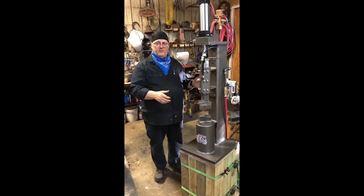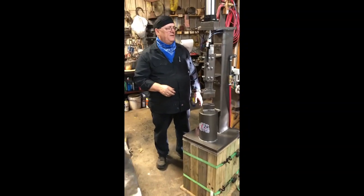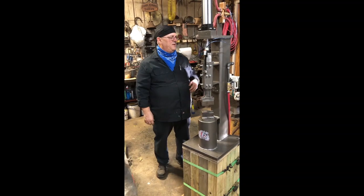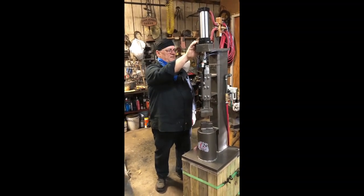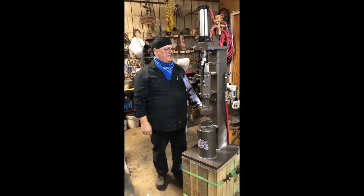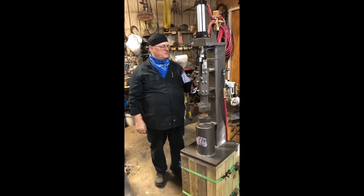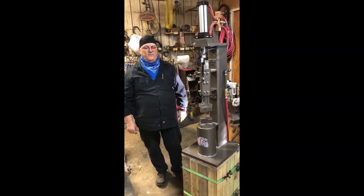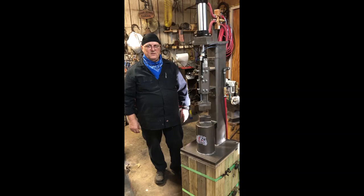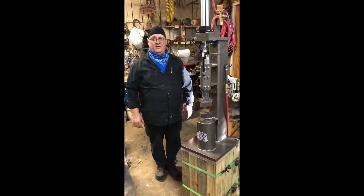You've seen it rocking while I was forging — I don't have it bolted down because it's not going to live here for long, hopefully. You need to put some angle iron tabs on there or something and bolt that down to your floor. The air cylinder on this one is a 2-inch bore, 6-inch stroke. I have it set at 80 pounds. You need about 4 cubic feet a minute for your compressor at 80 pounds, and about a 20-gallon tank to have enough gulp tank for this to run. But it runs smoothly and you can run it on a smaller air compressor if that's what you've got.